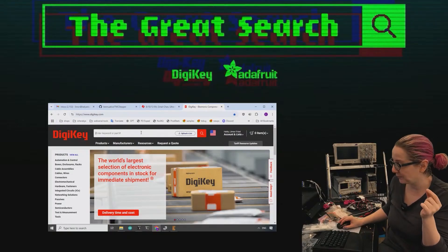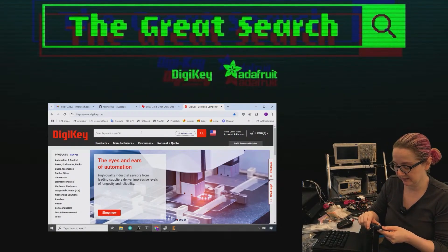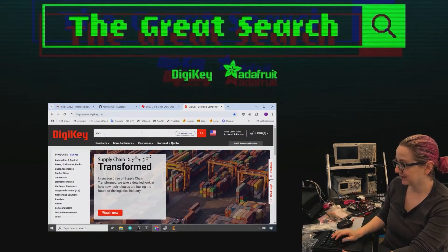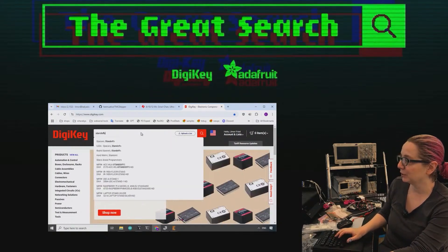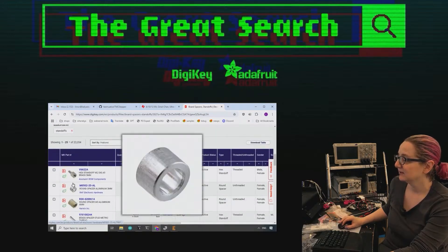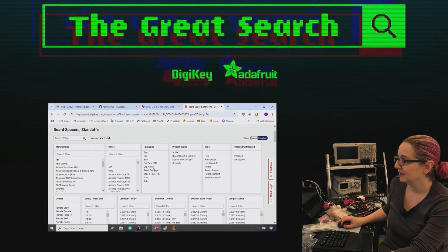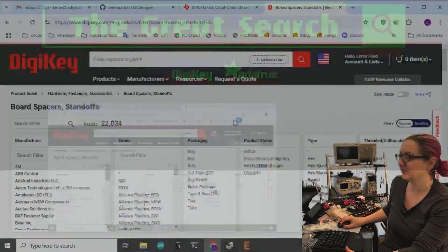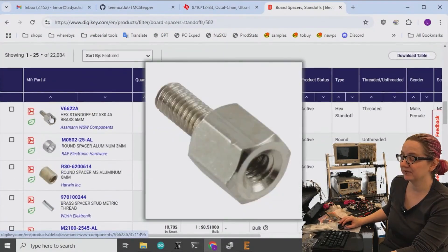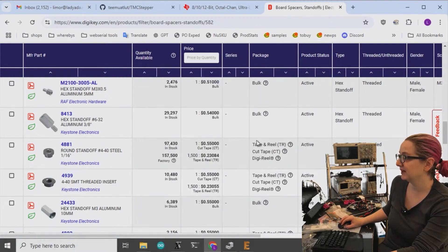For the ones that I want - because I have some components on the back of the PCB - I want it to be about six millimeters high. There are a bunch of different varieties. They're in the standoffs, board spacer standoffs location, even though the image shown is like a plastic piece. This has every kind of spacer, but the way you can tell the SMT ones is by their packaging. If you're getting bulk components that you hand screw on, those come in a bulk package. Whereas an SMT standoff comes in a tape and reel because it's pick and placeable.